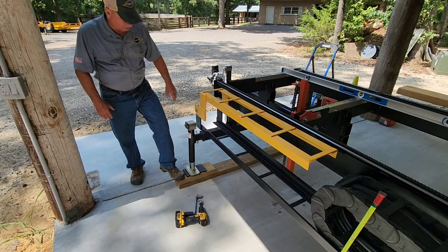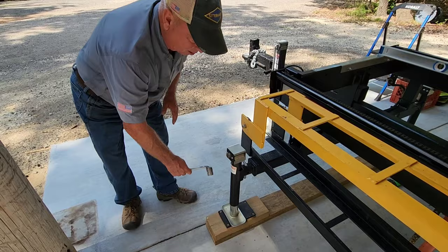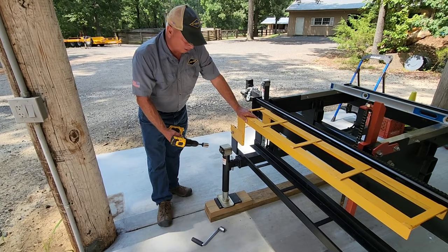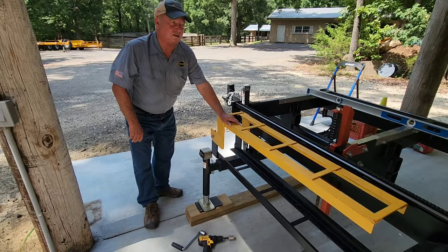One of the things I got tired of right away was knocking my shins on these little levers that were standard, so we knocked those off. It takes just a standard bolt or nut — found one that fits properly — and made this little crank. Now when I get on the job, we use an electric drill instead to run them up and down. We caution people: don't use the impact on this. They are a little tender — that little roll pin that holds the little bevel gear in there will not hold up to the impact. So just use the drill to speed up and down. No impact.